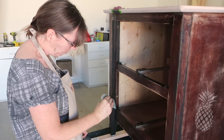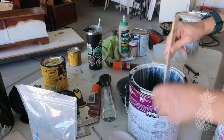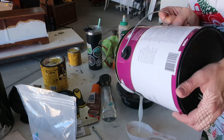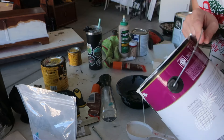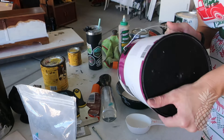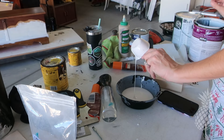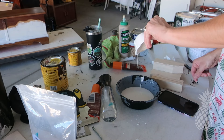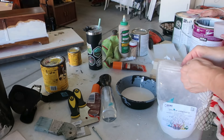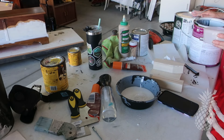For our thin white stripes, we made our own DIY chalk paint with some white latex paint and some calcium carbonate. We did this because we were trying to get rid of what's left in this gallon. But in hindsight, it was actually a poor idea. We should have just used our Sherwin-Williams trim enamel paint in a beautiful shell white, because what happened with this chalk paint is once we added the polyurethane, it yellowed by the next day. We just really hadn't used a white chalk paint with poly to see how that would happen. Lesson learned — we'll just stick with the higher quality all-in-one mineral paints. Instead we were trying to cut costs and save money with this chalk paint. Terrible idea.